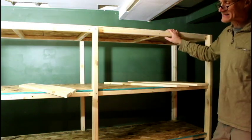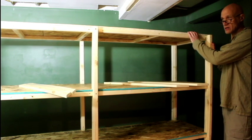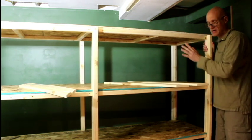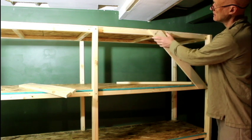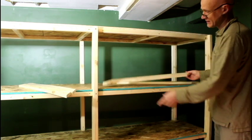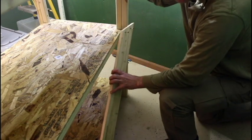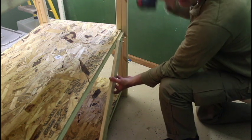The last thing I need to take care of is to prevent racking. It's actually pretty strong as is, and with light duty you'll probably be fine, but over time there can be lateral forces applied to this and it can rack — especially if there's a lot of weight. To prevent that, on the back side I'm going to screw in these boards diagonally, and that'll help keep it from warping. I'm going to put one at the top and one at the bottom on each side. These are 1x3s — I used these instead of 2x2s because I wanted to be able to put two screws at each location, which makes it a little bit stiffer.